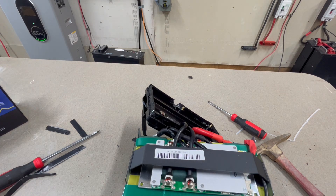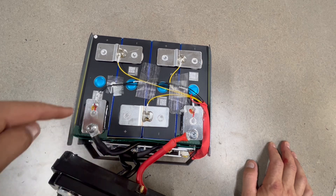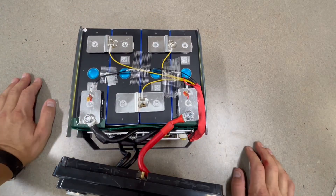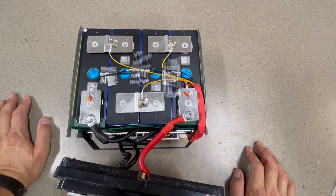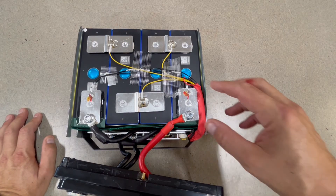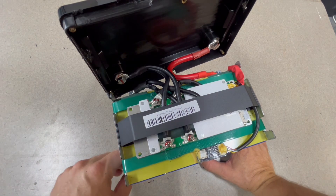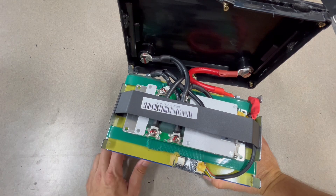Simple build, but not bad. We've got fish paper around the top end, insulator strips that run the perimeter, and two different metal sides used for compression — so you've got compression straps along the sides. These little tiny cells they use for the mini batteries are funny. Laser welded bus bars. Simple, and the leads are taped. I would prefer to have these insulated all the way up to the ends, but not bad — they have it insulated at the pinch point up over the ridge. It's just hard to believe you could get builds like this for less than $200 with discounts. There really isn't a reason for people to be using forklift batteries and old lead-acid batteries when you have options like this now.